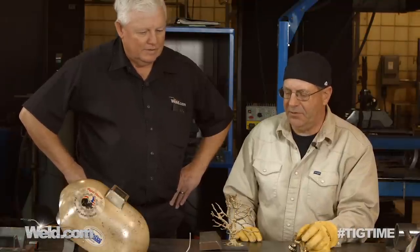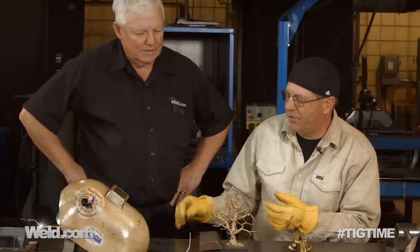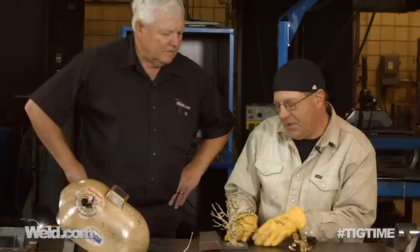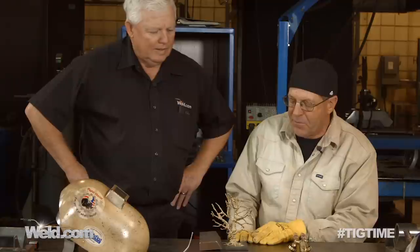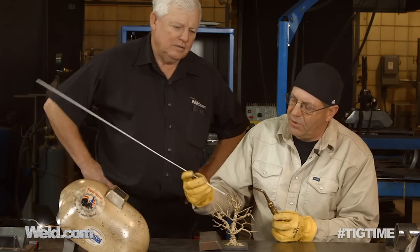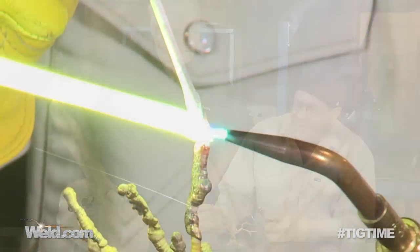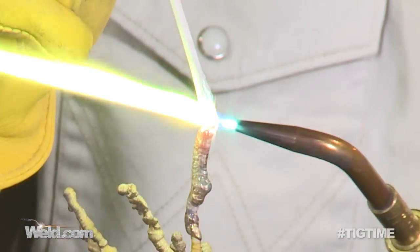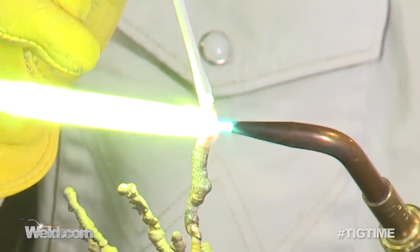The exercise is just vital when it comes to oxy-acetylene welding and TIG welding — you're manipulating a heat source and a filler wire. The trick is you clean off a piece of carbon steel, or any material you can start with. It needs to be cleaned. You start melting some brass and you can make your trunk. You have your heat source and filler wire — a liquid and a solid. It's a movement of an eighth of an inch, and if you're good with your filler wire, you can actually stretch this stuff out.